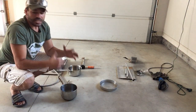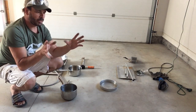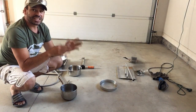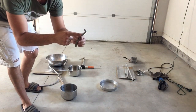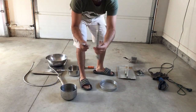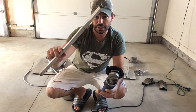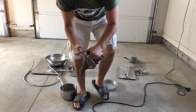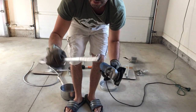The next test is probably the most effective: the spark test. If I use an angle grinder, aluminum when you cut it does not spark, but stainless steel does spark because there's steel underneath. I'm going to show you two pieces — this is a hose off of a barbecue with the brass fitting removed, and this is a random aluminum bar. I'm going to use my grinder now, and I'll start with the aluminum. First, let me put on my safety glasses because that's important.